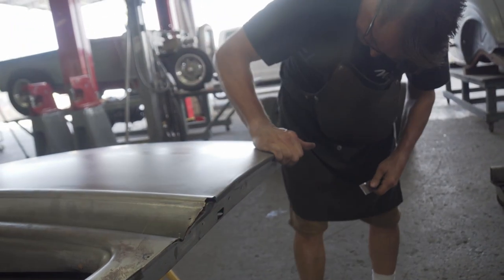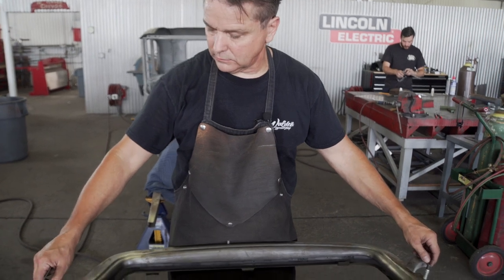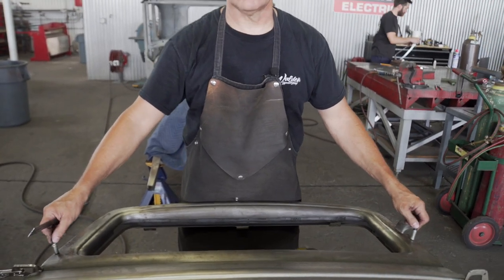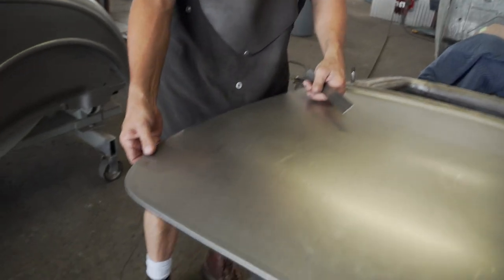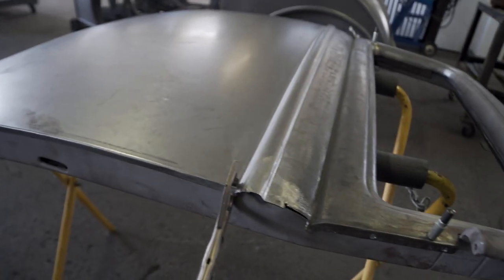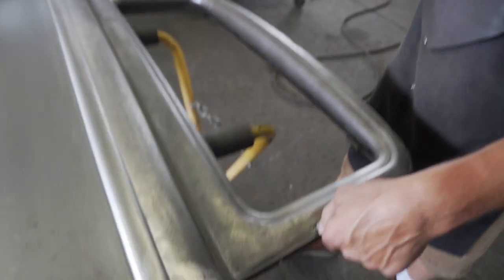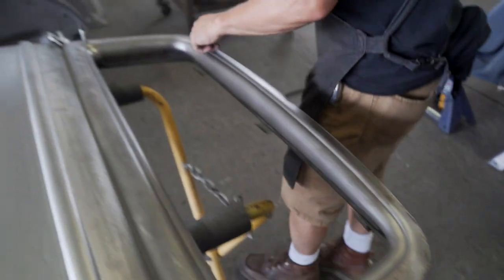You can see, we got our door flanged. We got it held on with the two original Clecos that we had. The flange goes over real nice around the door, all the way around. It's nice and snug, so it's ready to be hemmed over. So I'm going to replace this flange and this flange here and here.